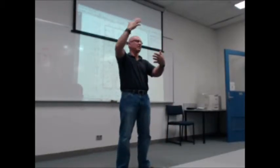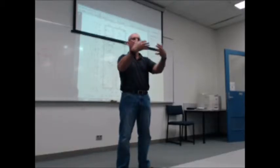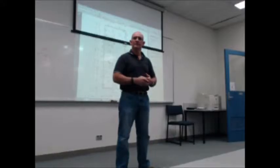Inside might be painted cream to match the rest of the house. Outside is painted black. It absorbs the heat. It shrinks, it grows, it twists because there's trapped air inside. It delaminates everything. What about black cladding, painted black cladding? Black. Everything. Try and avoid it. Bad.